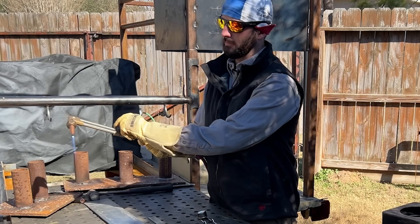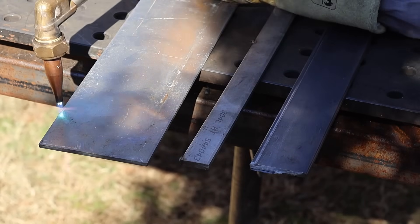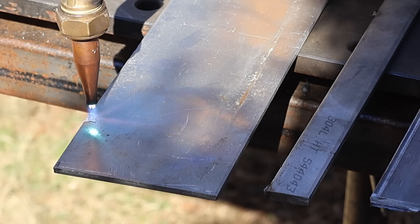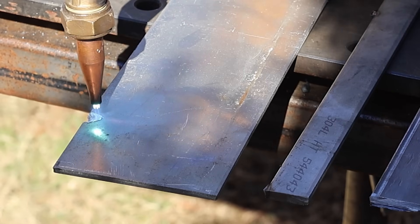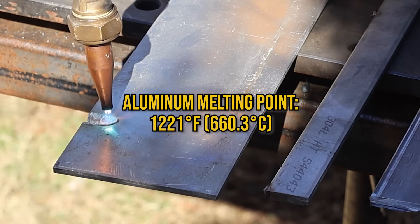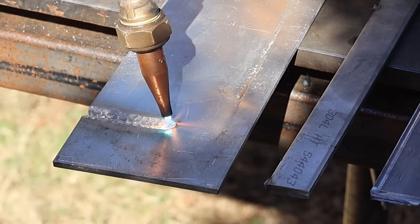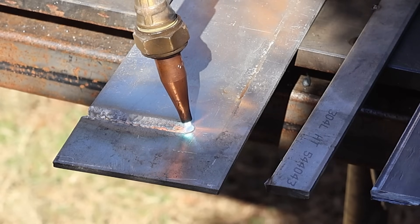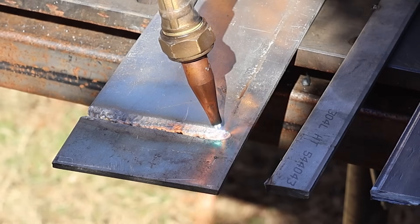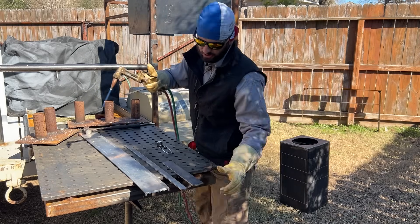We're going to go for a neutral flame and start with this aluminum piece. Being a non-ferrous metal, we should get a good idea of what's going to happen. You start on the edge, try to get things hot, but there's no iron oxide layer forming. Even when I introduce that oxygen, it almost keeps it from happening — it's just melting at this point. Aluminum has a much lower melting point. I'm not even using any oxygen at this point. I suppose if you really just had to and didn't care what it looked like, you could cut some aluminum this way — but again, I'm not even using the oxygen. The oxygen seems to actually slow up the process a little bit, ironically.